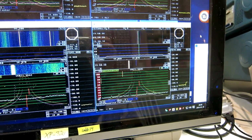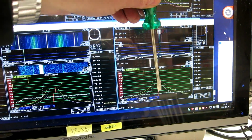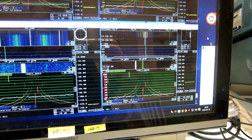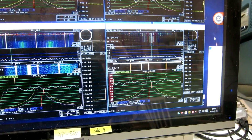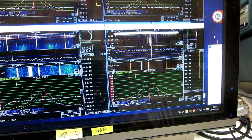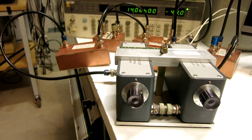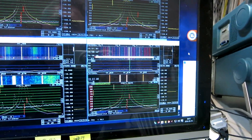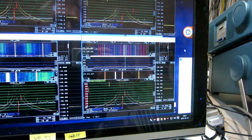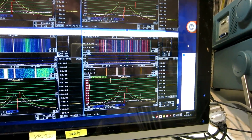I can go up in signal level here, and the thing corresponding to the sum frequency, the second order, is here. I continue up, and more and more. Here we got into saturation. So it's useful all the way up till, what do we have? Minus 10 dBm. But there is probably a risk of some false signals. But they don't grow like they would do in an analog radio without selectivity at the front.